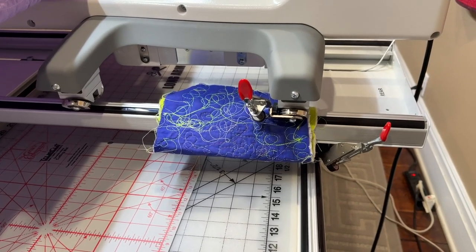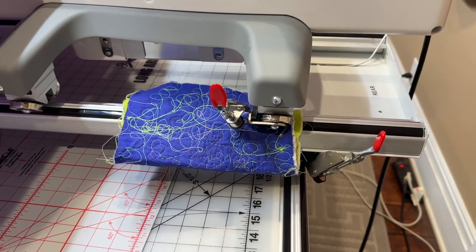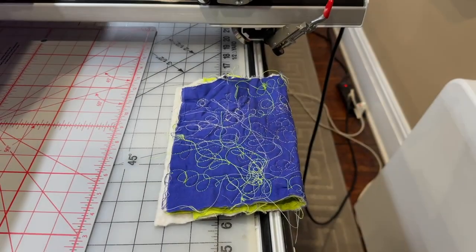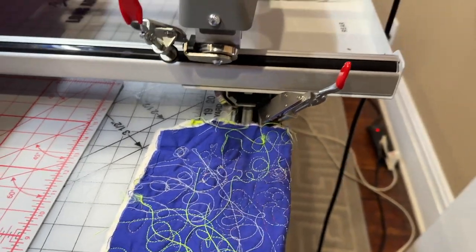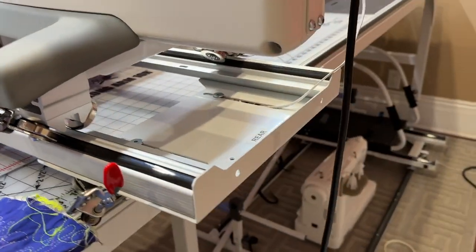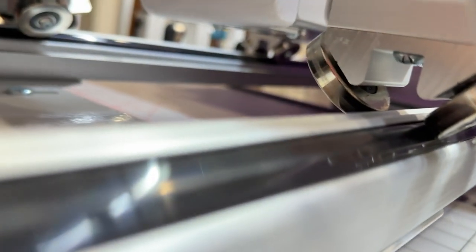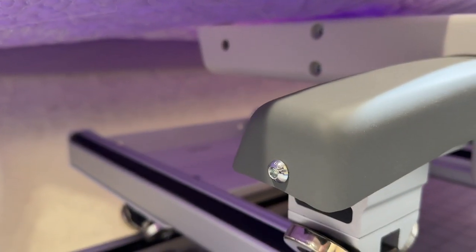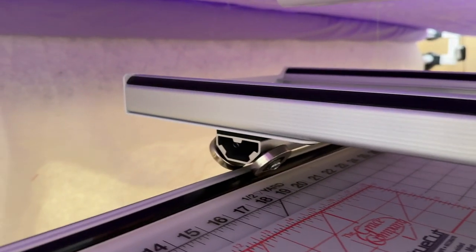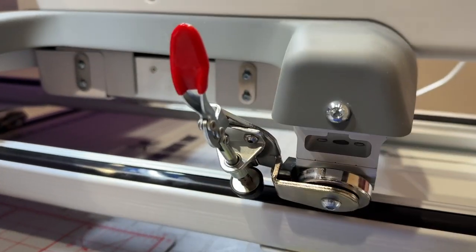If I have this under the wheel that's attached to the machine, then I can go side to side. If I put this under the wheel that's on the carriage — and by the way, make sure that when you do this, don't put it on the side that has the encoders on it, that's not a good idea. You can actually put it on the front wheel if you want, but it would be really hard to get on that wheel, so typically doing them on the rear wheels like this is your best bet.